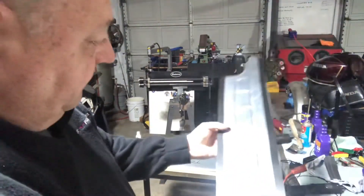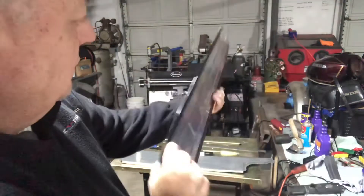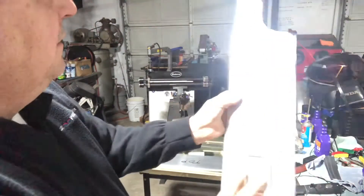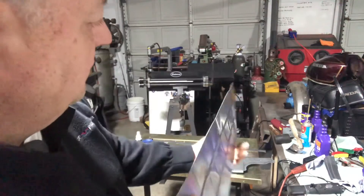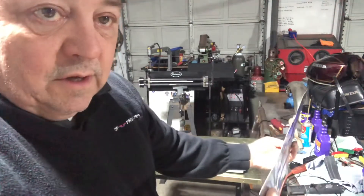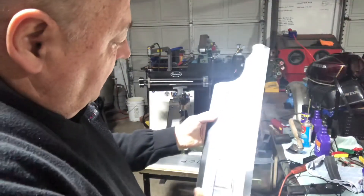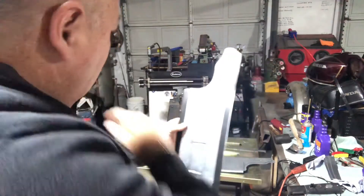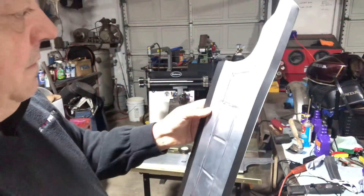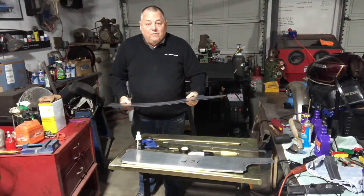It came out pretty good. For the thickness of this material, I think our bead development process was pretty good. We did two light passes with the planishing hammer right on the center line of the beads, and then came back and made one pass on the bead roller. I see one more spot I want to go just maybe a quarter inch farther. Okay, I think we're pretty happy with that — well, I don't know if you are, but I am.